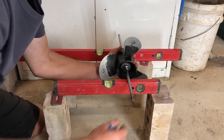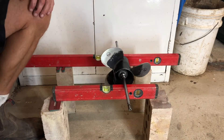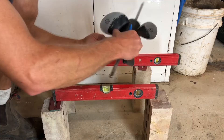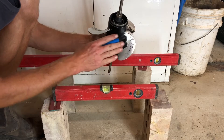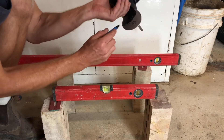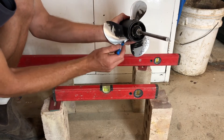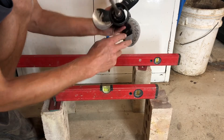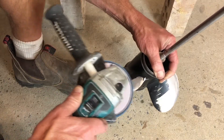We'll have a look to see which blade is heavier. Blade number one is definitely heavier than the other two, so we'll remove some material from this area here and blend that blade back in. You don't want to take any material off the pressure side of these blades — it's quite a specific shape to cut the water — but you can remove it from the back edges to reduce weight. Keep a close eye on how much material you're removing to leave enough strength in the blades.